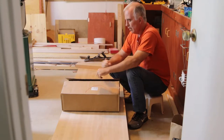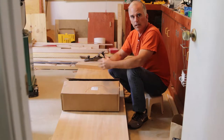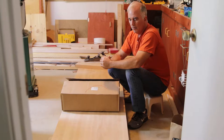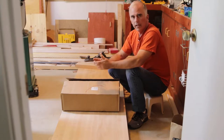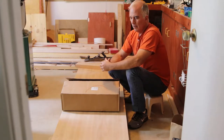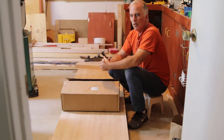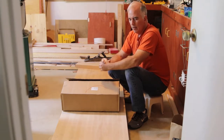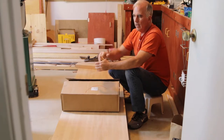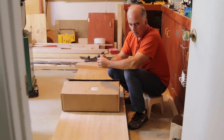The top is coming together. This is the bottom of the top, so it's flipped around right now. It's getting close to being done. I haven't shown too much of that because a lot of it I was using the hand planes and I'm just not very good at that. It worked but it was difficult. I was having a problem with tear-out and still kind of have a problem with that even though I did a back bevel on the blade to try to increase the angle to stop the tear-out. It still was tearing out — I don't know why or what I was doing wrong.